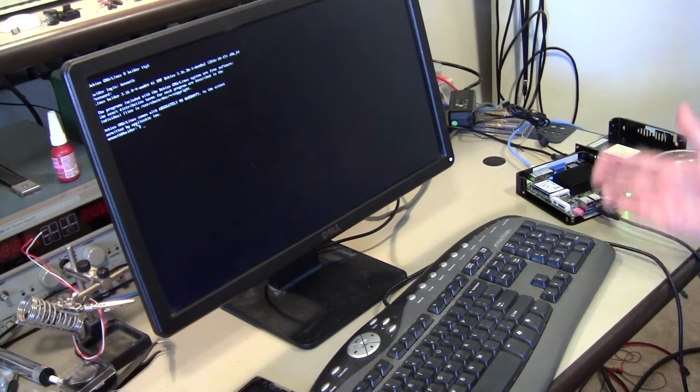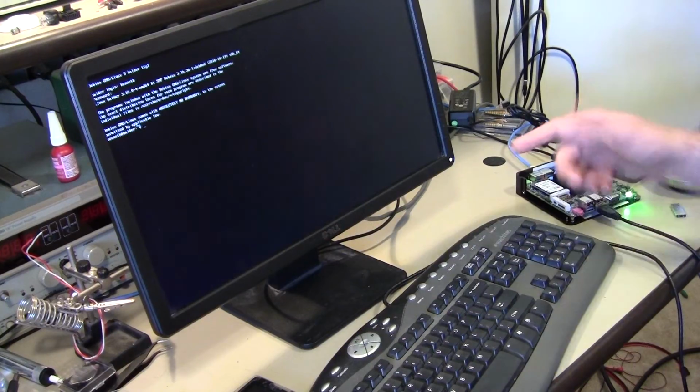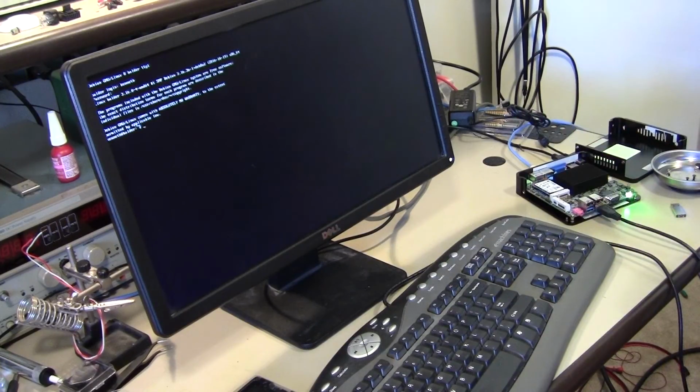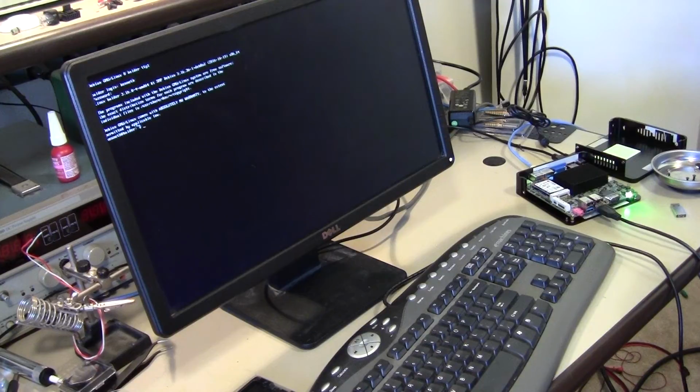Alright, so there we go. Kind of uneventful Debian install. It did ask for the Realtek drivers at the beginning since it didn't have the firmware for them. I just declined that option and it ran with whatever fallback it had, which was good enough for this. So at this point, if I really wanted to get the most out of these gigabit NICs, I should go hunt down the firmware online or from repositories.